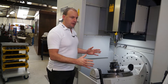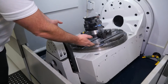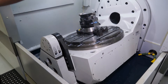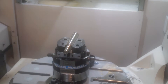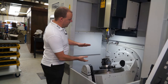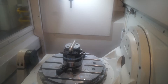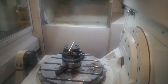A neat characteristic of this machine is the table. You can see there is a ring which is taken off of the table. When the table is tipped, it enables you to get closer to the end of the component with your drill or cutting tool. The table also has a hydraulic clamping mechanism, which means that when you are in position, it's clamped so you can really look to remove material and do some high performance machining.